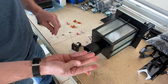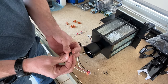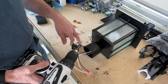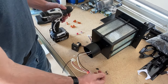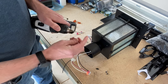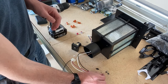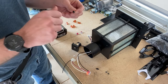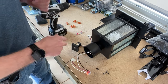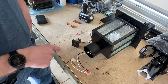You'll usually have three mounting screws for the fixture itself and two mounting screws for the photo cell - bring those with you. You need to start the holes in the post, so I'm using a 7/64 drill bit, which matches up well with the screw for a nice pilot hole. This is also why you want that post to be secure - you're going to be pressing and screwing in, and if the post isn't secure, you'll knock it out of plumb and all the work you did to level it will be wasted.